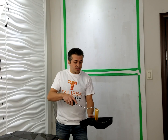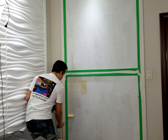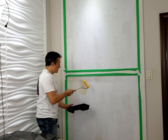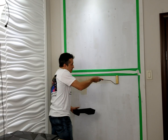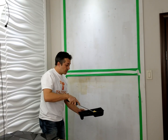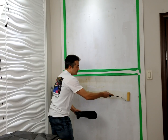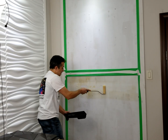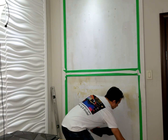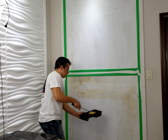Now with the contact cement, when I apply it, you have to let it dry for a bit. So in my case, I will apply the glue right away for both frames. This is, by the way, why I installed the masking tape. So if any of the glue will touch the frame, I can take the masking tape off later on and paint the frames. Love the smell.